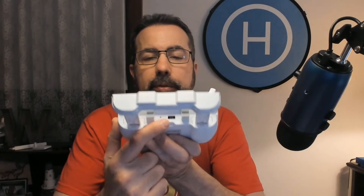We're going to fix that today with a special tool from Hubsan. Turn the controller off, and you're going to take your USB cable — your micro USB cable — and make sure it's a data transfer cable. The other thing you're going to need is your jumper tool. Hubsan sells a jumper tool to jump these pins. If you don't have that tool, there are different things you can do — you can use a PC motherboard jumper.